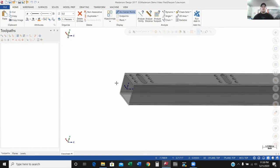Basically, to create your program, your machine is going to run whatever you program in Mastercam off of a certain location. In Mastercam, that's what we call our WCS — our work coordinate system. You can see the gnomon placed on this part as a kind of pre-setting. What you need to do is program this part off of wherever you're going to find your work offset on your machine.